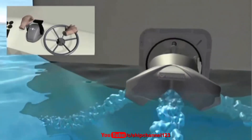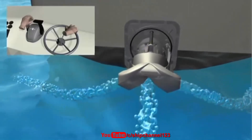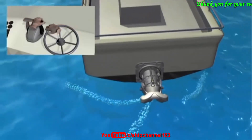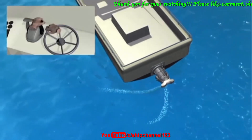The astern deflector can also be lowered to a central position where forward and reverse thrusts are equal, so the boat is able to maintain its position regardless of engine revs. Steering control is still available in this zero speed position, allowing the operator to fully rotate the boat without moving ahead or astern.